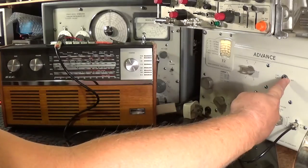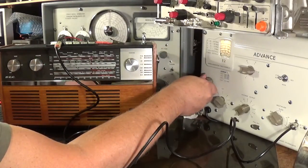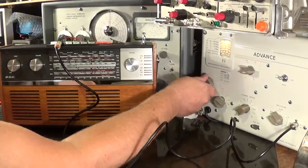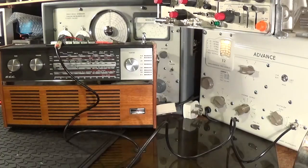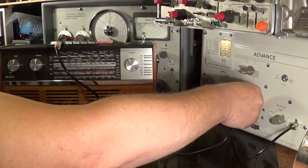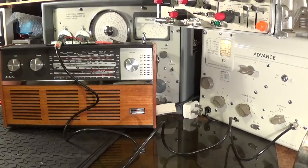Now let's try it with the internal modulation off and just the carrier wave — you'll hear a different sort of noise, a rushing noise and then it will all go quiet. Did you hear that sort of whistling, descending noise? Now you're dead on 800 kHz here, and if I switch the internal modulation on it will come blasting through. You can reduce the internal modulation by turning your attenuation down. So that's the simple connection — it's called loose coupling — your signal generator output is loosely coupled to the radio.